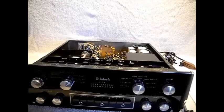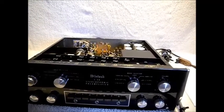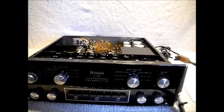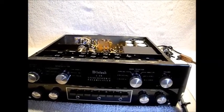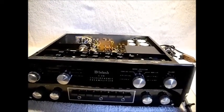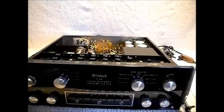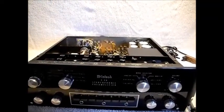When you turn off your system, you first want to turn your amplifier off first, then turn off the preamp. If there are noise artifacts that are going to come out of the preamp upon turn off, you're keeping those noise artifacts out of your speakers because you've already turned off the amplifier.